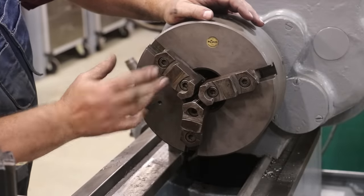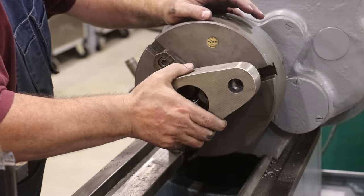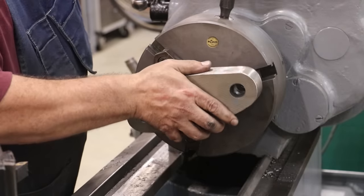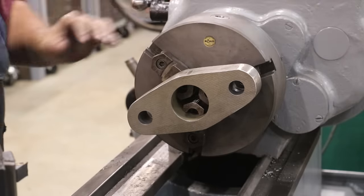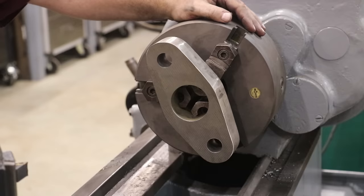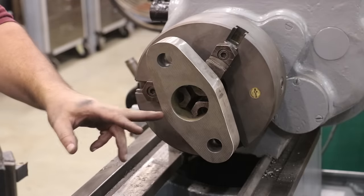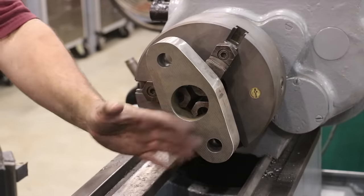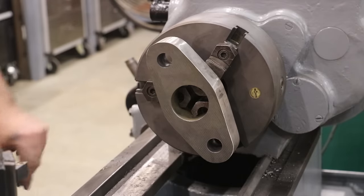I'll turn the jaws on my chuck back around to their normal mode. What we're going to do is grip this on the step on the inside of that hole we bored earlier. We'll basically slide it up on here and expand the chuck out until we grip that. That should be square with the work we did before, and we can come in here and start working on this side. Now it's going to be an interrupted cut, but we can work around that. My goal is to get the total thickness of this part to about an inch and a quarter. There's going to be a little ring around here, then it'll step down about an eighth of an inch, and then the rest will just be the thickness for the boss. So first thing we're going to do is get this thing cut down to size — I've got about a quarter inch to come off.